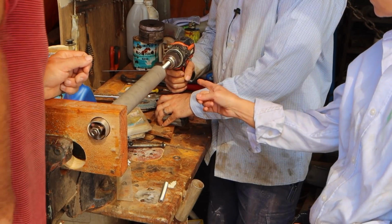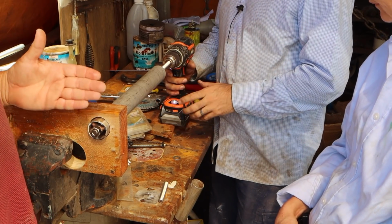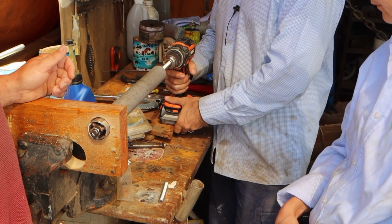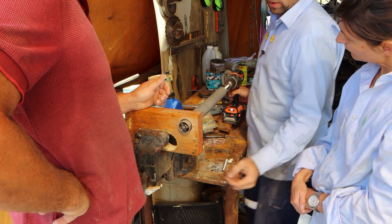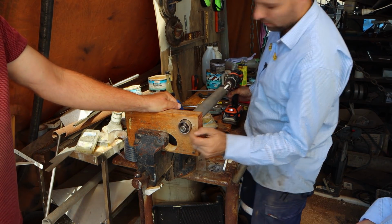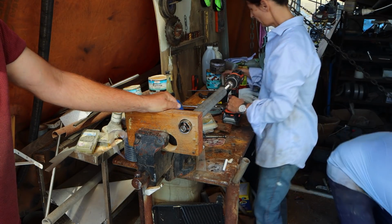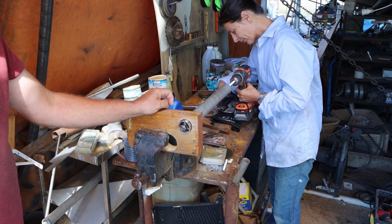It can't be that out that much on the top, can it? No, but a square cut, it's rocking, so it has to be the shaft. It can't be anything else that would make that happen. But I don't think we're going to get it any better than that. But what I'm thinking is if I can buzz that, and then I'll get my flapper, and I can get right in that edge and flapper that down spot on. So if you can do a consistent speed, I can do that. Try it, just play around and see what we can get to work.